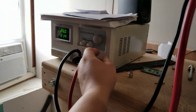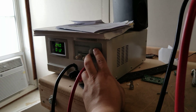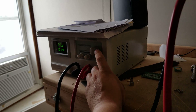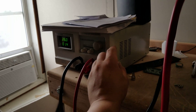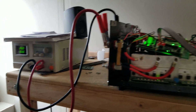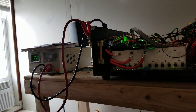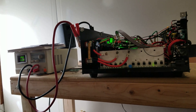This unit draws 1.4 amps — at 24 volts if your battery gets that low, you're drawing 1.2 amps. At typically where my batteries are, around 25 to 26 volts, you're looking at about 1.4 amps with fans off. Turning the fans on, you're looking at about 2 amps with both fans running — that is the standby loss with nothing plugged in, approximately 2 amps at 26 volts.